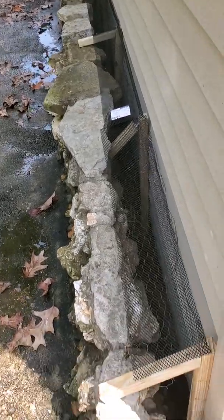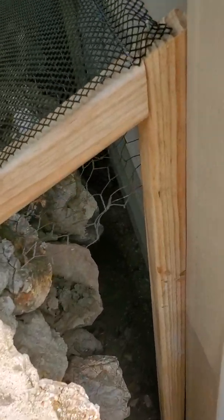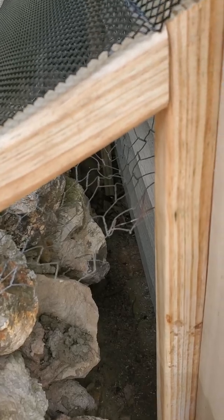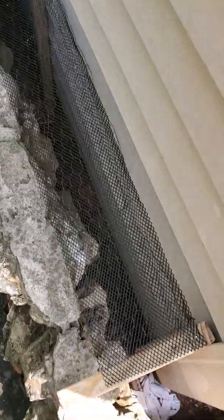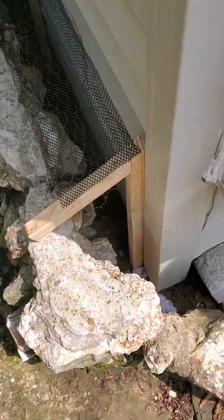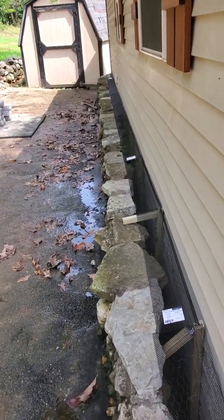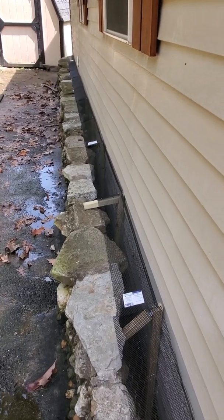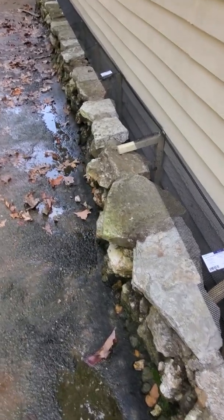So when they built the retaining wall — I don't know if you can see it — they put chicken wire in between the wall and the house. What that's supposed to do is catch the leaves and keep them from piling up under the house and creating a huge moisture barrier right there in that little three-foot section. It keeps the leaves from going down there so it always breathes, stays dry, and you don't end up with mold issues under the house. So I understand what they were attempting to do with the chicken wire.